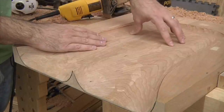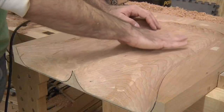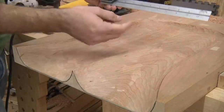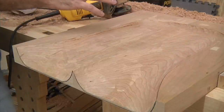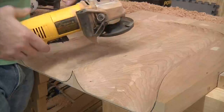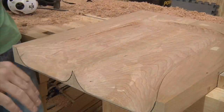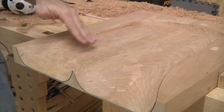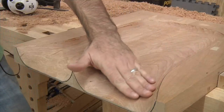At this point, I think we're pretty much done. We probably could go a little bit deeper in the seat — if I were really making a full-on chair seat, I'd probably sit in this and see how it feels, and then determine if you need to go a little bit deeper. I would also take measures to make sure the depth is consistent on both sides — you could actually get a dowel in a piece of wood, push it down, and compare how far down the depth is. One thing I learned in the learning curve: you can really do gentle cuts and you can do aggressive cuts, but you need to understand and get to know the blade. Over time I may develop skills good enough to really smooth this out and decrease the amount of work I have to do after I'm done.